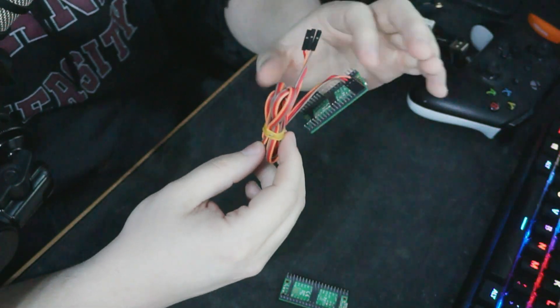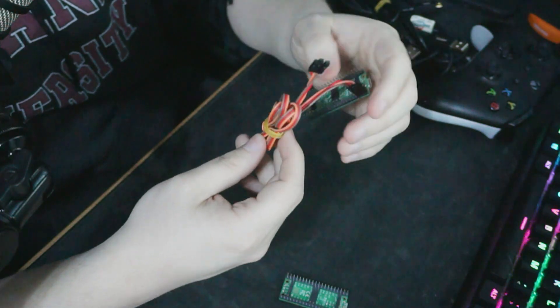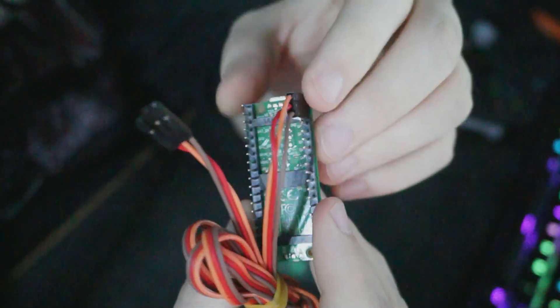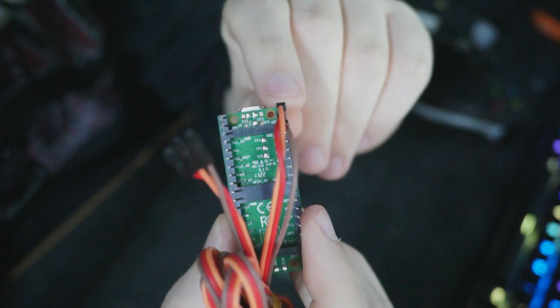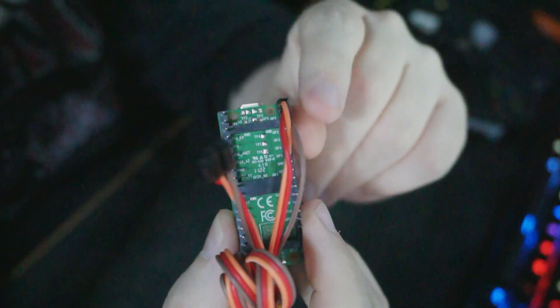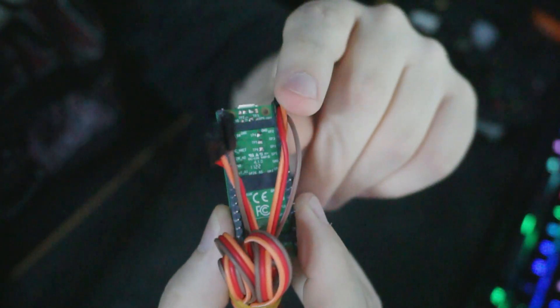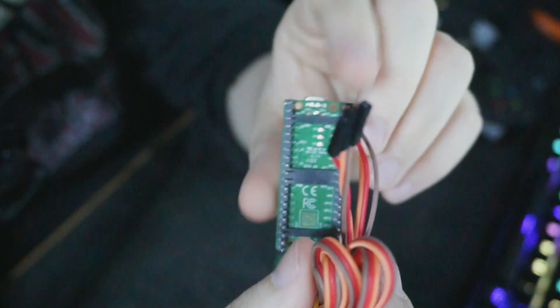This is the computer side. It's important because the wiring is a little bit different on the console side. On the console, the first three pins to the right of the micro USB — you can't see it but it says GP1, then ground, then the top one is GP0. So GP0 is orange, GP1 is red, and ground is brown.